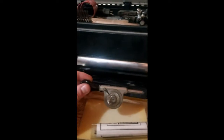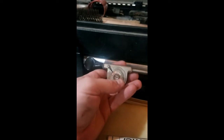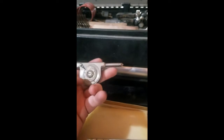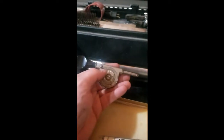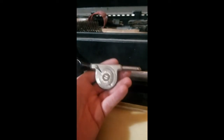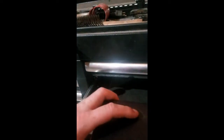And we have an old school tachometer. And how this thing works is you put this end against whatever's spinning, and it'll cause this to spin. And then you just count how many times that little nub goes past the marker there. Every time it goes past, it's 100 revolutions, and you just keep track. Time it for a minute or 10 seconds, times it by 6. That gives you your revolutions per minute.